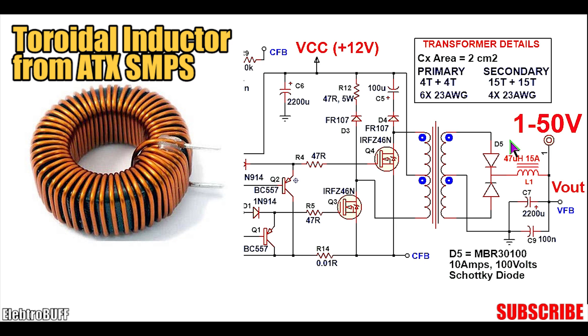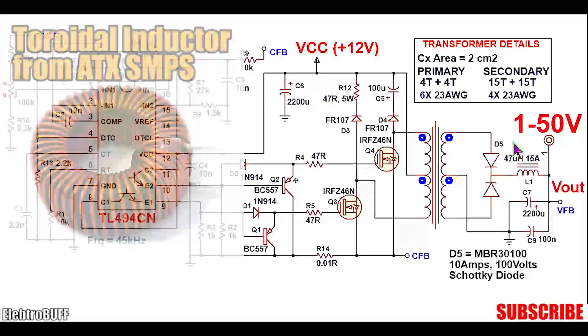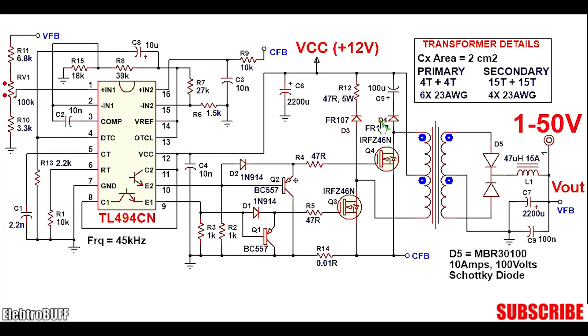The inductor can be anywhere from 47 to 220uH. I prefer a hand-wound inductor because you can use a much thicker wire or many strands of fine enameled magnet wire. Diodes D3, D4, capacitor C5, and resistor R12 form a snubber circuit that protects the MOSFETs from damage caused by EMF spikes generated across the primary winding of the transformer. The spikes are conducted by D3 and D4, charging capacitor C5, which is then discharged by resistor R12. R12 can get quite hot so ensure it is rated at least 3W, preferably 5W, and it is 47Ω.